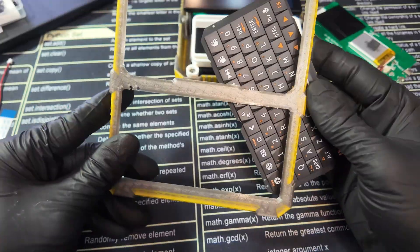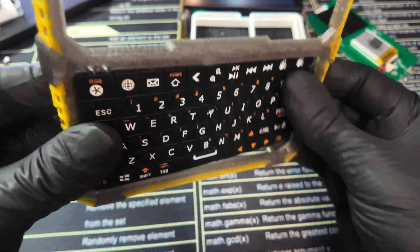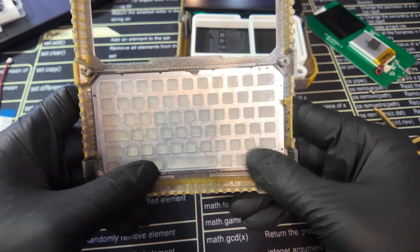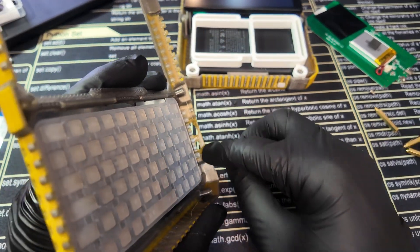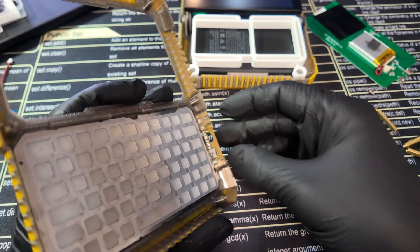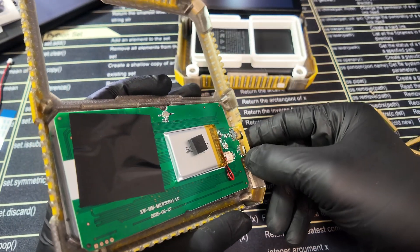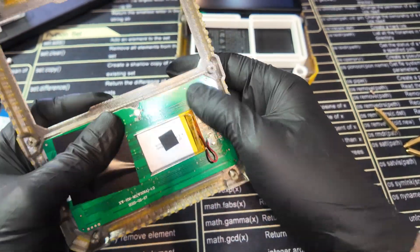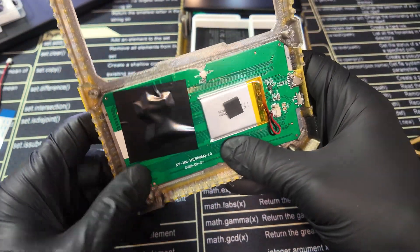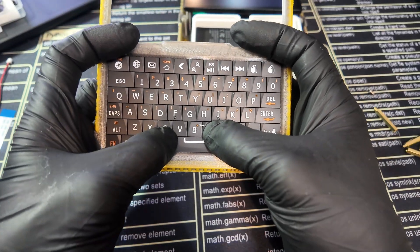The first thing we're going to do is pay attention to the front panel housing. Match the two LEDs on the keyboard PCB with the two holes in the front panel housing, then firmly push it into the clips inside. Take the on/off switch and place it right in its slot. This is the tricky part — make sure it's clipped and don't snap the switch. Firmly place it so the clips around the edges hold the PCB. To verify you've done it right, turn it on while holding it in place and try pressing the keys.